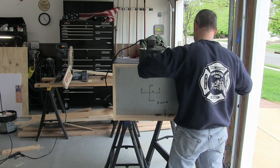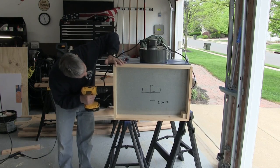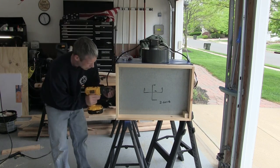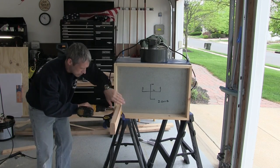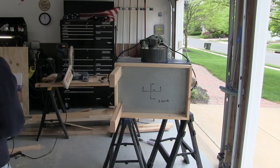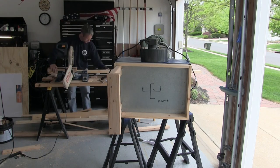Here I am starting to build the cart to support the spray booth. I used 2x4s and 1x4s. There was a little lip — I drilled through the lip of the metal and screwed that into the wood so it is attached. I didn't go too crazy with too many screws so if I have to take it off it doesn't take too long. I wanted this spray booth to fit fully underneath the fascia, so I tried to make the overall height 44 inches, but the space below for the compressor kind of prohibited me from making it any shorter.